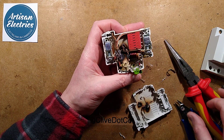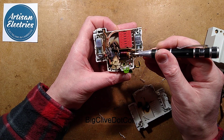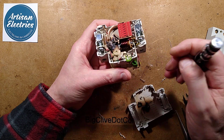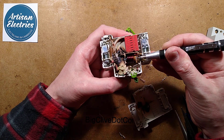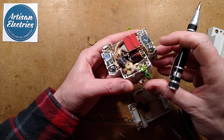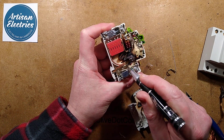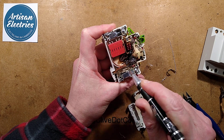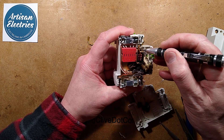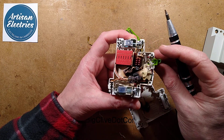Here's the trip coil - that's the overcurrent coil. This is a little plunger that can go down, and under overcurrent conditions it will hit the trip mechanism. Here's the bimetallic strip that detects slow simmering overload. If I flex that, it will trip it as well. So that's the bimetallic for slow simmering faults just above the rated current, and this is the solenoid that effectively detects those high current peaks. After that it looks very similar to a fairly standard circuit breaker.